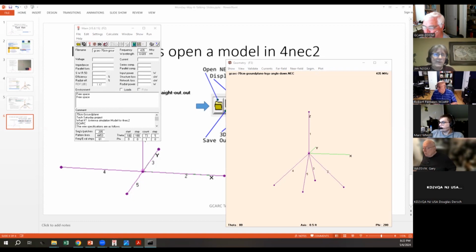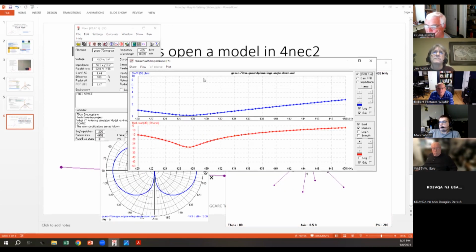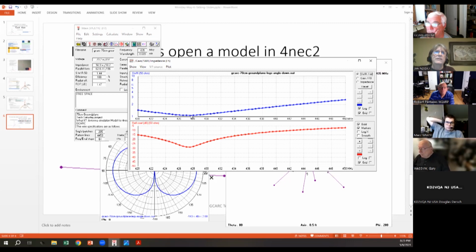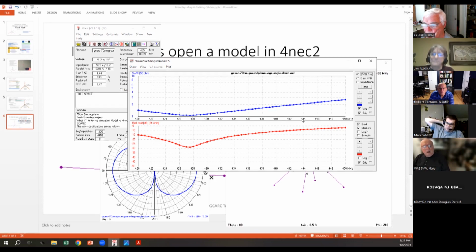Somebody said you had a better impedance match. Can you define what it is that you mean by that? Well, you're closer to 50 ohms now, where you weren't before. Yes, my low point is not above 2. My low point is now close to 1-to-1. Good. Anything else that you observe?